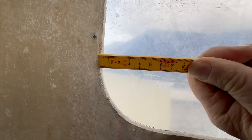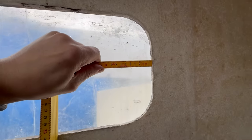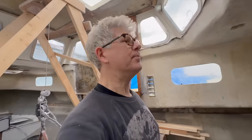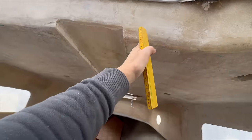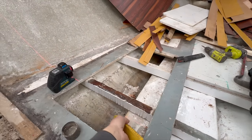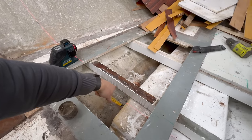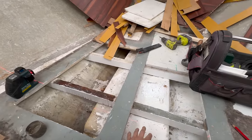If we take the window and measure, we can see that it is 2.25, while on this side where it was wider below, it is actually 1.9. What I need to do is measure from what we can see. What is important is probably this structure, and if we can get the wall to follow this structure as close as possible, it will end about here and look okay. The question is whether this bulkhead should end here with an opening underneath, or we should cut away this and let the bulkhead go further down and maybe follow this cast iron keel. The problem with that is that if it squishes towards the iron keel, it might make noise as the boat rocks. What do you think? Please leave a comment below.